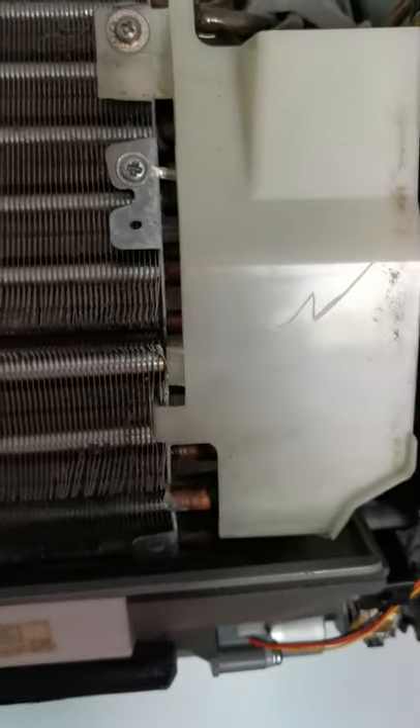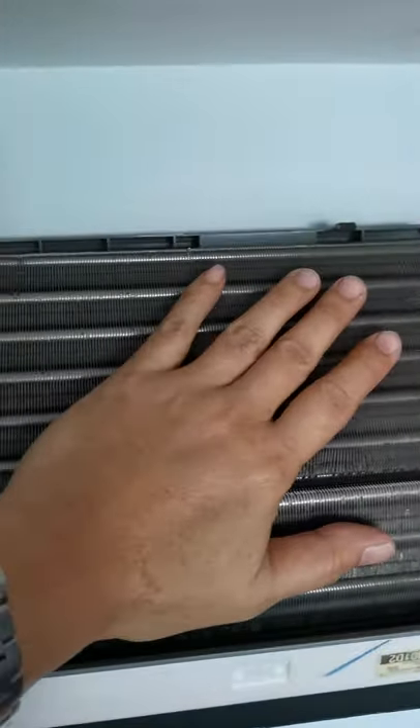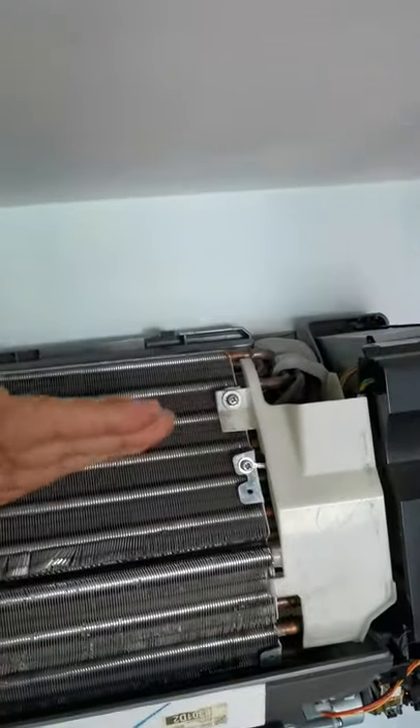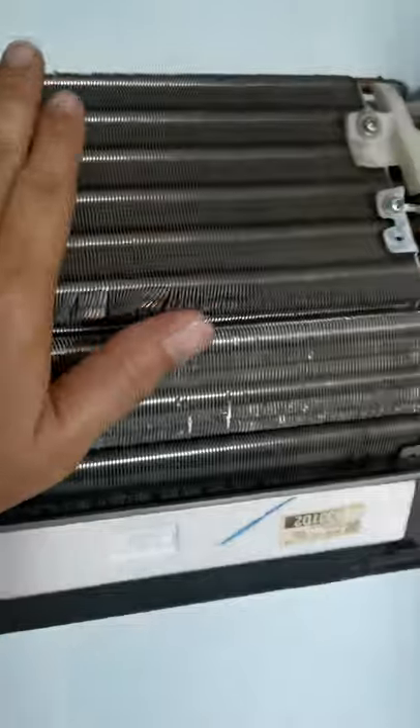So what is aircon water dripping? You see this is the fan coil, and this surface is very cold, probably 3 to 5 degrees Celsius. As the air sucks through, it cools down and comes out from the lower here. This cold surface, being so cold, naturally produces a lot of condensation.